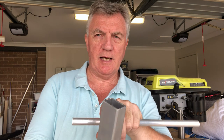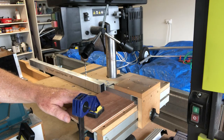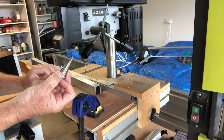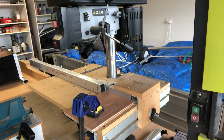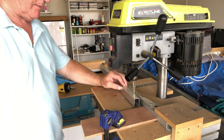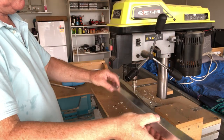We've got to make up the base frame. I'm going to take this 16mm tube and cut a 16mm hole through the end of this cross beam and right the way through the other side so it fits through. I've set the piece of wood up so there is 98mm from the center point of the drill. The drill is 4mm - the reason being that on my step drill the first step is at 4mm - so I'll drill a 4mm hole all the way down. Now I've put the step drill back in and I can start drilling the 16mm holes through the cross beams.